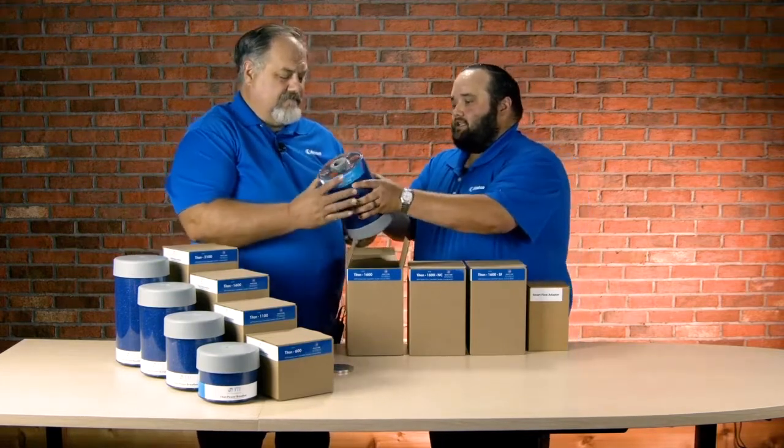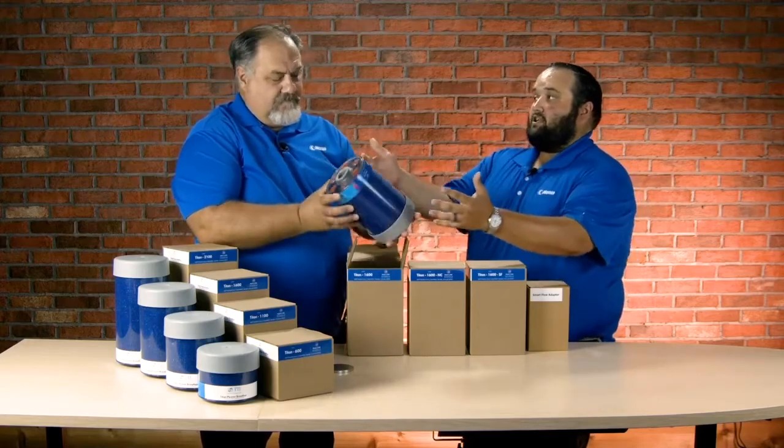They call it the standard, but it's got six check valves — three of the check valves oriented inward, three of the check valves oriented outward. So this breather is going to be able to breathe in, exhale, but stay sealed when it's not actually needing to breathe.